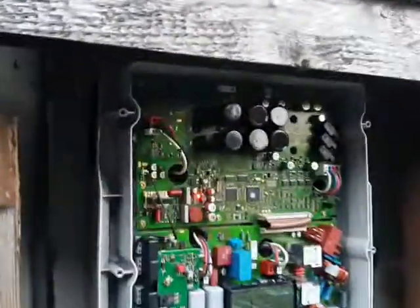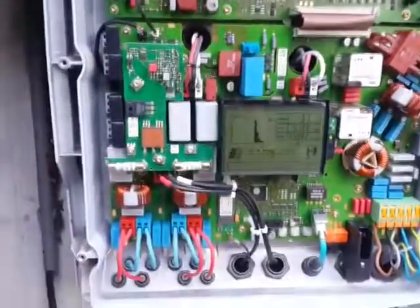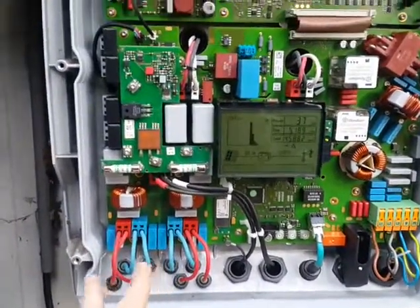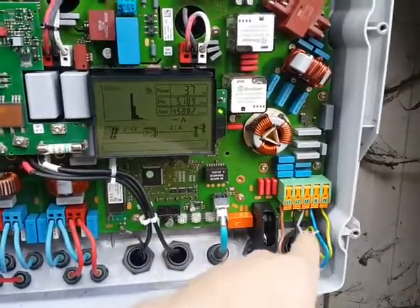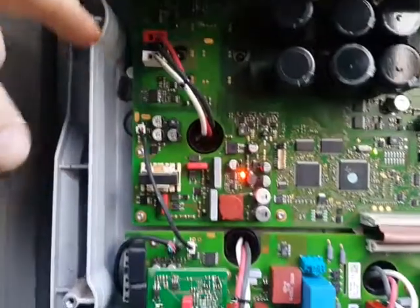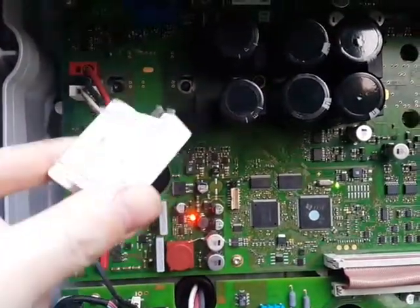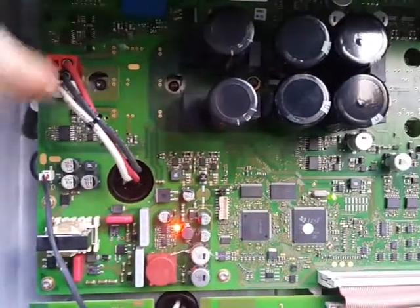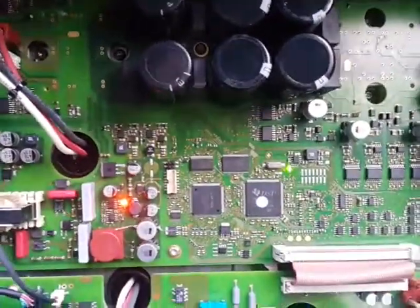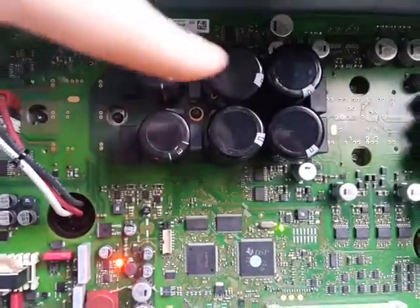Well, there are two boards in the inverter. This below board with a display, lots of filtering, and the top board with chips. The solar input is here, two strings, DC, and the output 220 volt, 3 phases here. Via this section, the DC comes to the first IGBT, and the IGBT looks like this. It's on the bottom side of the PCB. This one is in a chopper configuration, and then the output, also DC, will be on a capacitor bank here, 6 capacitors.